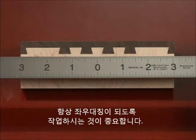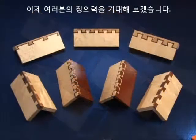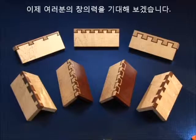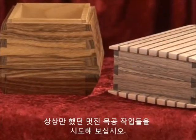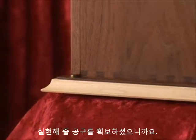For this demonstration, we've centered for 2.5 inch wide material using the Box G template with 8B as our center cut. Begin by moving the fence to a scoring pass position and lock the carriage in place. Slide the Lexan measuring scale to read 0 under the cursor.